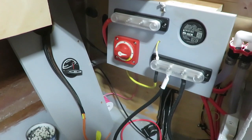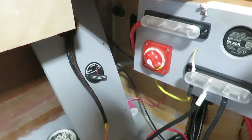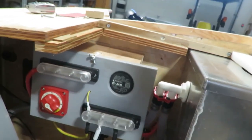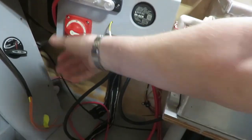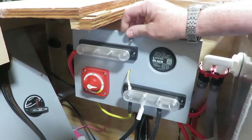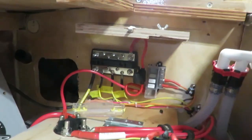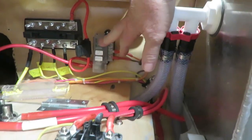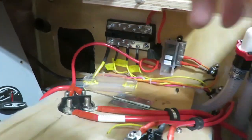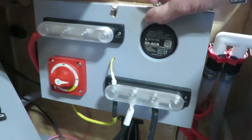With the exception of: if you go to start your boat and the cranking battery is dead, you turn this switch to combine, and then you can start your motor with the house battery. Once the engine starts and begins charging the battery, you put it back to on, and the current relay regulates which charging current goes to which battery. Behind here, down in here, that's all the wiring for the house battery. I've got my fuses over here, and here's a positive and negative bus on this one, which feeds all my other things. There'll be another wire that runs up to the driver's seat where all the other switches are going to be.